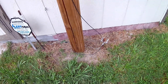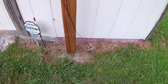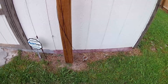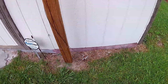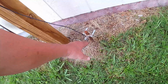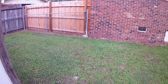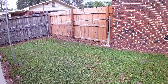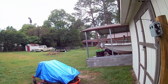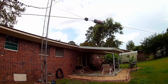I've got a 12-gauge aluminum ground-type wire that runs into my shack. I don't have any radials — they seem to think they're not necessary. I'm not saying they won't help the antenna do better, but I don't have any. I do have one ground wire that goes around, buried, running along here and over to the fence, tied into the chain link fence which goes around my yard.